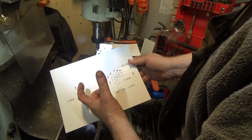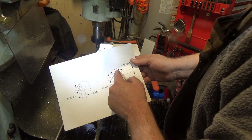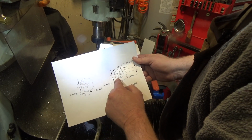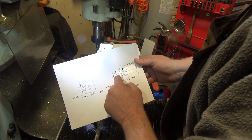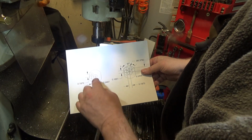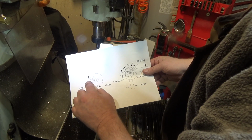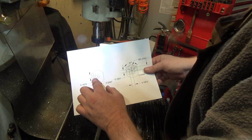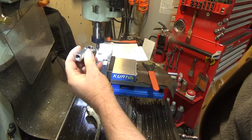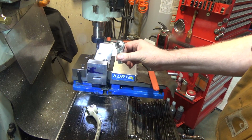This has to go about 1.6 inches deep. So if I go 0.2496 up and then rotate plus or minus 48.5 degrees, I will get this curve. And then I can do the exact same on this other side. Then if I go straight out and over up 0.1651, I will clear out almost all of the material inside this part. Then I follow up with a 1/4 inch end mill and just go up and down on both sides by 0.1872 off a center line. That will allow me to get almost perfectly this straight section here. You will notice that this is slightly curved. I can just round this off a bit, and that will create my D profile, which will help support this part.